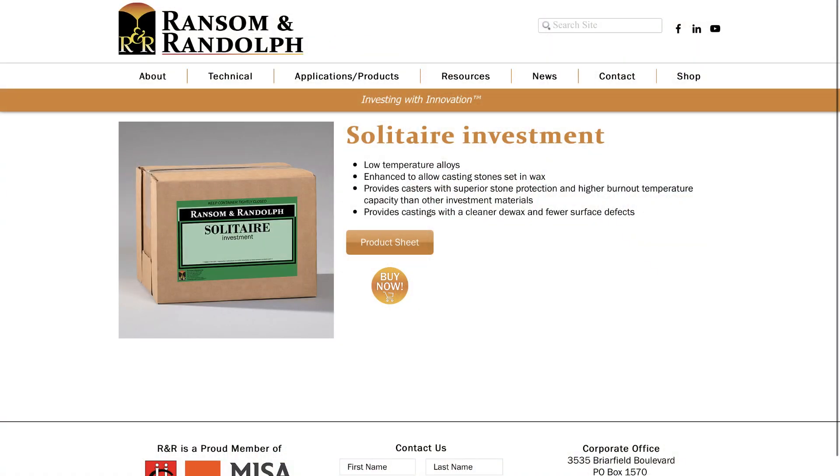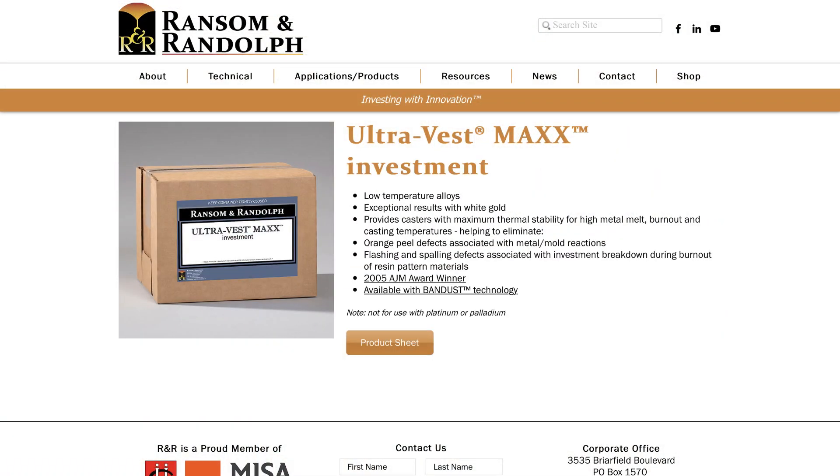Next in line is Solitaire, designed specifically for stone-in-place casting. I do not recommend you ever use this with 3D printing because it requires a much lower firing temperature — I believe it's at 1,160°F. You'd want to use this because stones can be temperature sensitive, so lower is better. You really only want to do stone-in-place with specific stones like diamonds, sapphires, and I think rubies. Then they have UltraVest and UltraVest Max — very general-use investments designed mostly for wax. We actually started with UltraVest casting some 3D prints, so it can be used, but use that information with caution. Try it first — it would be worth getting a little bag before buying a whole 44-pound box.